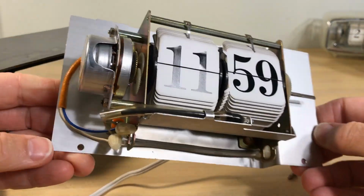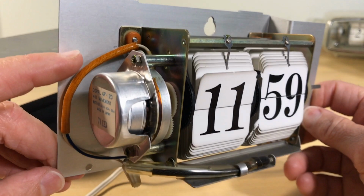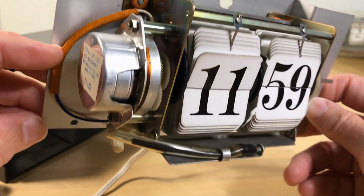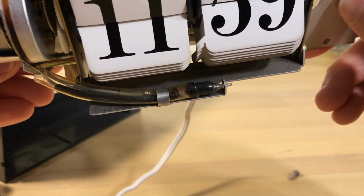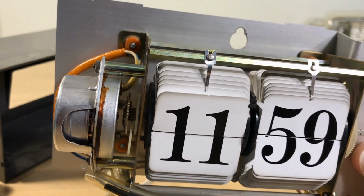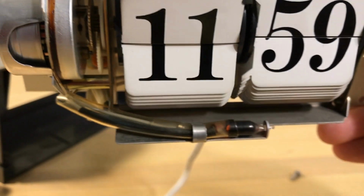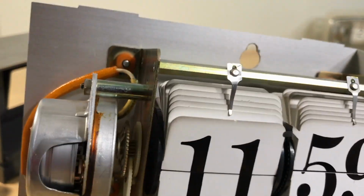Absolutely. So you look at this situation and say, what do we got? Well, there's a couple signposts here. We have this varnish-impregnated fiberglass. These will break and crack, but when you see that, you know that probably this has not been messed with. You see a neon glow bulb that is very blackened. It does work, believe it or not. When I plugged it in, I thought I saw it. Let's take a look. Yes, it's glowing just fine, but you're not going to be able to see it because of all this stuff here. The only thing you can do there is replace that bulb.